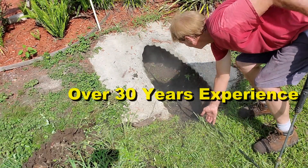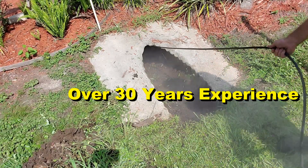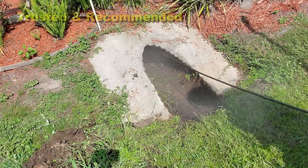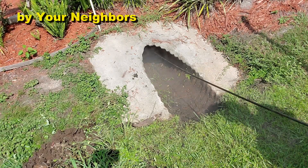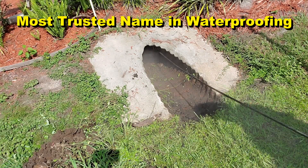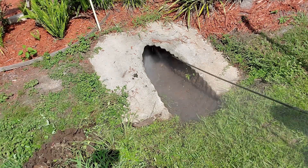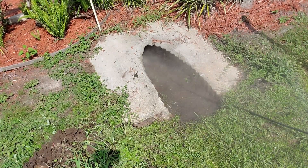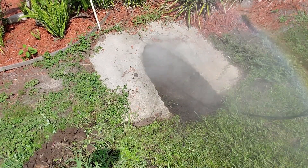This is an 18-inch galvanized steel culvert, and you'll notice it's cut at a 30-degree angle with concrete placed around the side. That's code here — almost everywhere in Florida you're going to find the same code. It could be ADS pipe, doesn't have to be corrugated, could be concrete, but it must be cut at a 30-degree angle with concrete about two feet on both sides of the culvert, and there must be sod alongside of the culvert.